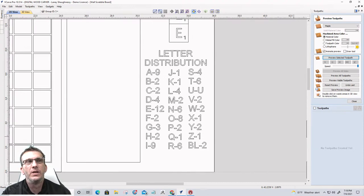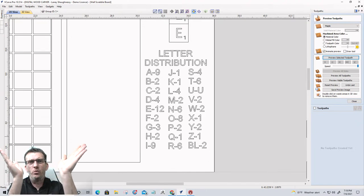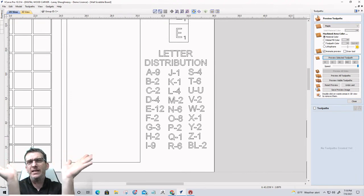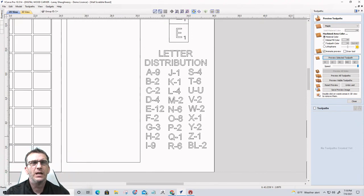The design is really going to dictate what the cut's going to be, depending on what you want. You might not want a V cut. You might want a flat depth, right? And you want to flatten out your letters, but you want your wall angles to be a certain angle and then your flat depth. So you might want them to be 22, 60, 90, 120, and then go into the flat depth, right? That's just, again, it's going to call for what the design calls for.